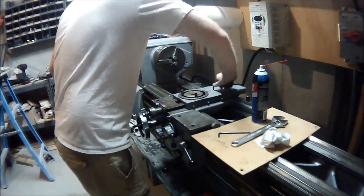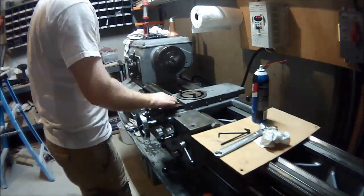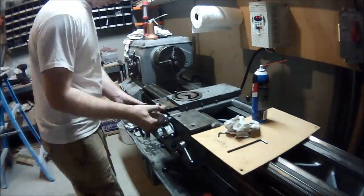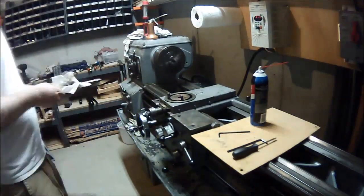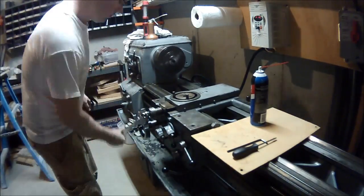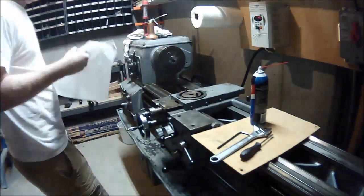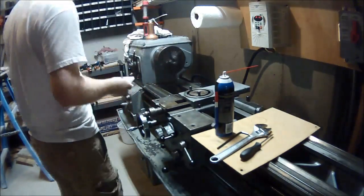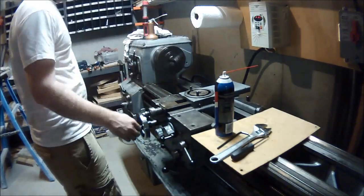I put in the two Allen head screws in the front and tighten down the back. Since I didn't have a knuckle buster, it was rather difficult. I actually used the VFD in the cross-feeding part of the lathe to check it out. A VFD has an awesome feature of an amp readout — at least mine does. I could see when it was binding up, with amps going from about 4.2 to 5.8 or 6, which was a really good indication.